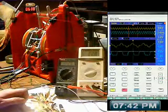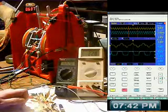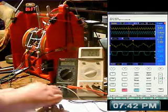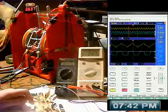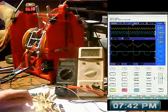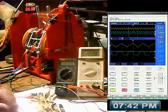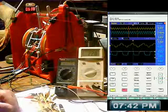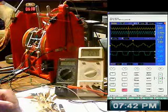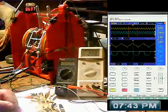Yeah, it's going back up in speed, and current hasn't really changed that I can see. Oh, it's actually stopped climbing again now. Let's take it out again. That should go up to 640 again. Unless I've got some glitch on my power current regulation, which is possible because that power supply is a little bit glitchy on the current limiting. But yeah, it did seem to drag it down more when I put that capacitor in.